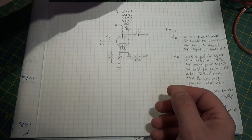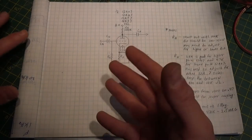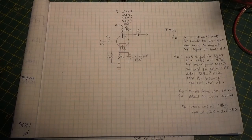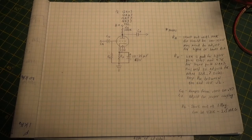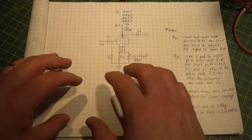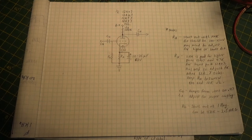What the plate size can tell us is that some tubes can handle a little bit more power than others. But none of these are really designed to be power tubes - none of them can go more than a fraction of a watt, or one watt maximum. They're really not designed for power. They're designed to amplify the gain of a signal. So you're just adding gain - amplifying the signal voltage. You're not amplifying the power. There's a big difference between that, and I think that's where some people get confused.